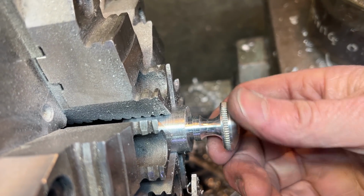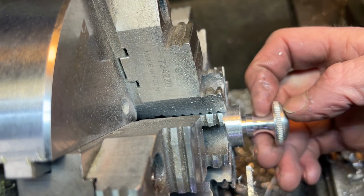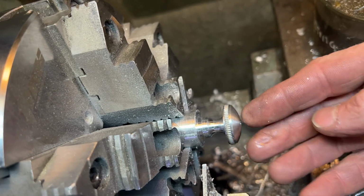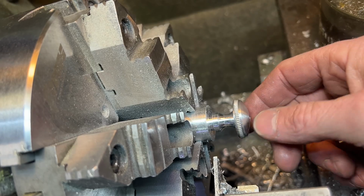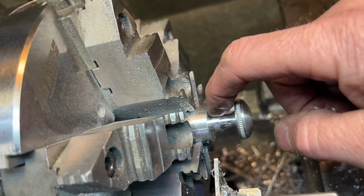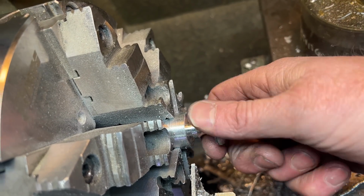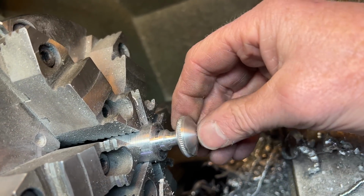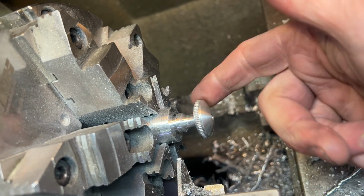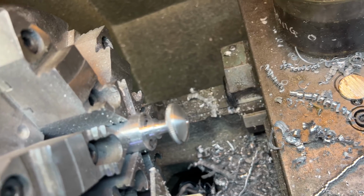The basic body of the plunger. You see that? That's the profile. I'm going to clean this up a bit. First, I'm going to tap an 832 hole here so I can thread it onto the end of the rod. Then I will go in with some sanding paper and some emery and other stuff to clean this up, polish it up, make it look like a little like steel. And then that'll be ready for the back of the syringe.